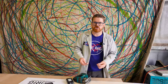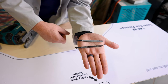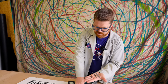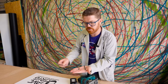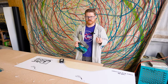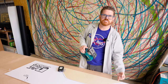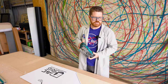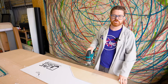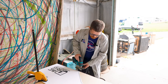There are two different kinds of bits you would use for a jigsaw: an up-cut bit and a down-cut bit. The down-cut bit gives us a clean edge on the top surface. Since this is the back side of our panel, we're gonna use an up-cut bit. I like using an up-cut bit because it gives me a clean edge on the bottom side of the panel — and that's the side that's gonna face the interior of my van. We'll move our work piece over the edge of the table and cut the rest of this out.